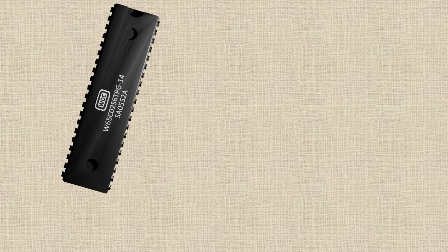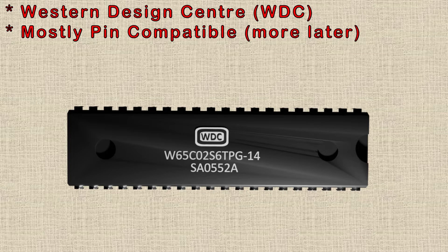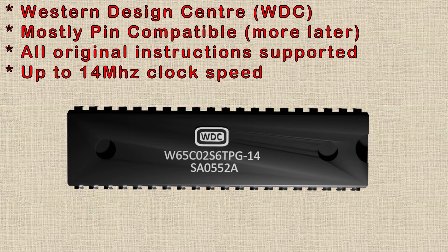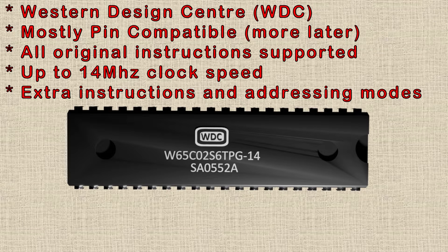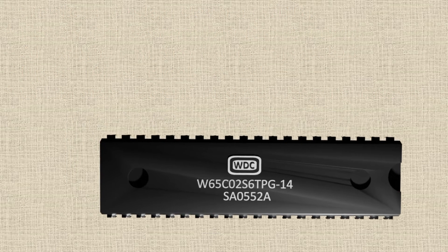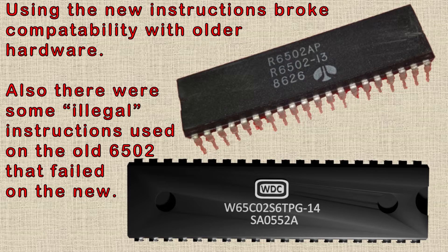I'm going to go through the more modern version of the 6502 from Western Design Center called the W65C02. It is mostly pin and fully instruction compatible with the original 6502, but can run up to 14MHz compared to the original 1MHz and the later CMOS 2MHz versions. It also has some extra instructions and addressing modes. Wherever differences occur between the various versions I will endeavour to point them out. I would recommend that if you are planning to build your own system you buy the new Western 65C02 rather than reuse an old one, as I will take advantage of new instructions and addressing modes when I see fit.